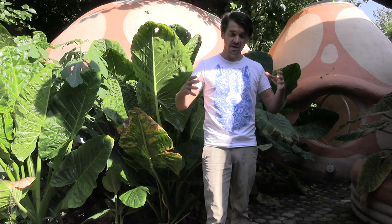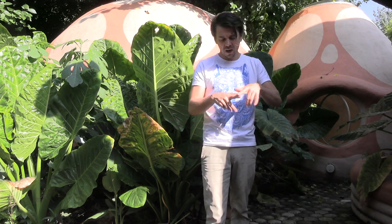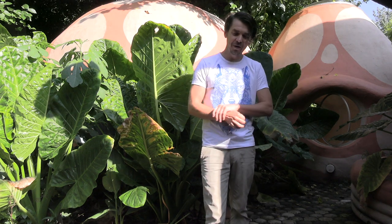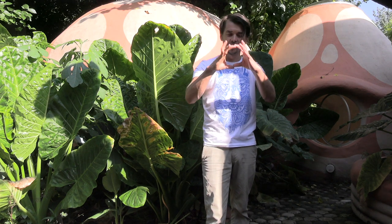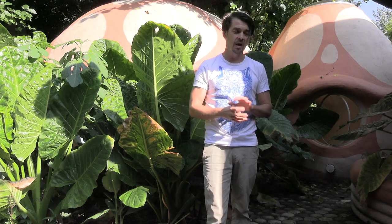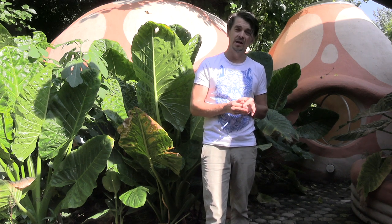When I did the rebars for the ferro-cement roof of the underground water tank, we came a bit too close — we weaved them and they created a funny little entrance way that is very small. What I would do is, when those weaves come through, connect a ring first — make a metal ring out of rebar, a nice size, maybe two and a half foot — and when you weave your rebars, you actually weave to the ring around, and then you have this ring that will keep a nice entrance manhole. That would be the only mistake, because our entrance is very small and only a person like myself can get in to maintain.